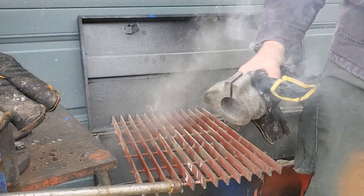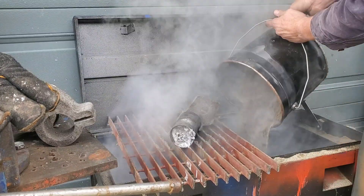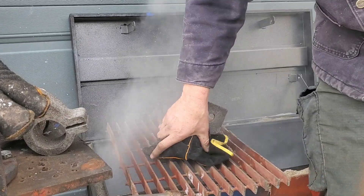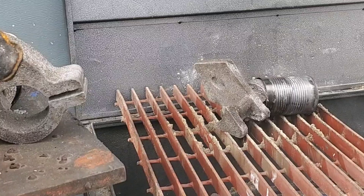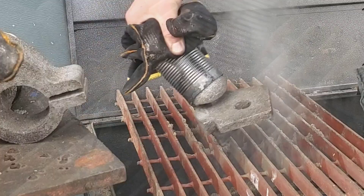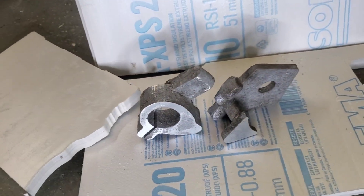One learning point I can offer: those half-inch holes I thought I was saving time on were kind of a waste, because the foam distorted enough that the holes weren't going to line up perfectly. However, it's pretty easy to just drill a half-inch hole now. I just need to get the Milwaukee bandsaw and hack off those sprues, then take it over to the mill machine and machine it up. It was really cool hanging out with you today — check out the burner video or the other video that you might like, and we'll catch you in the next one. Have fun, get over to the shop, and make some chips!